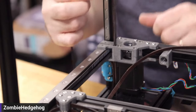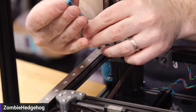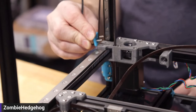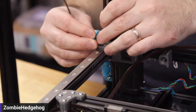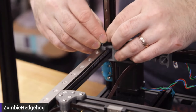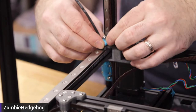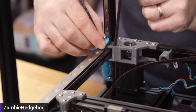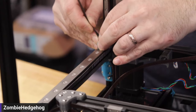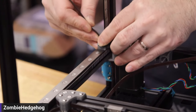Take the end of the belt and insert it up through the mouth — there's a little face on this thing. Insert it through the mouth, up, then move it down. The goal is to get this kind of pre-tensioned. You want the tension of the belt — how tight it is — to be in its final state on the slightly loose side. You need to be able to tension it but also be able to install it. I usually get it installed and back it out one tooth at a time until I feel the belt has enough slack.